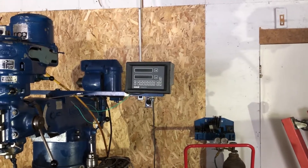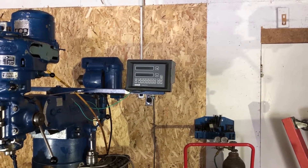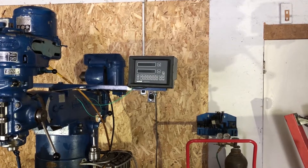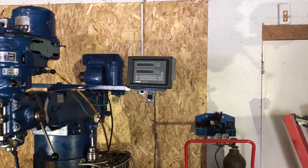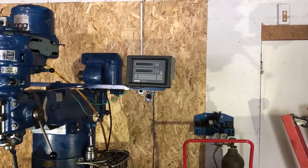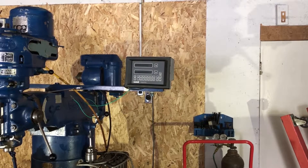The intensity of the readout kind of varies up and down some, so there's got to be an internal issue there. The problem is I know the scales on this machine work. To get a replacement readout for this would probably be about $1,200 at least from Newall — that's more than I've got in the mill. So we'll look at seeing what it takes to fix this.